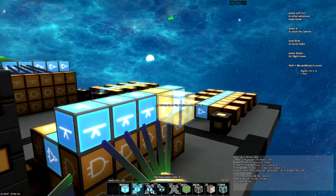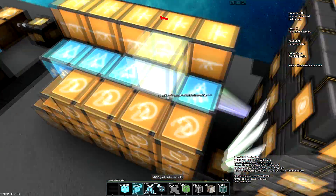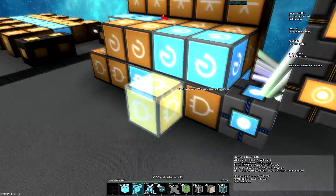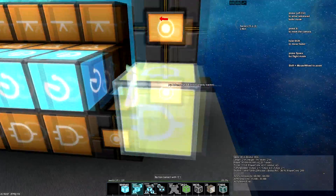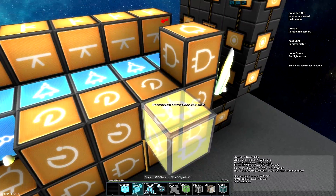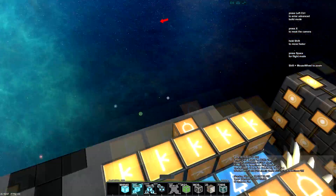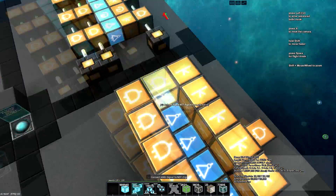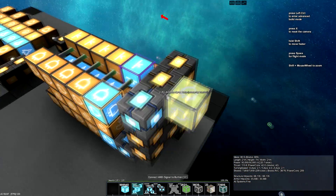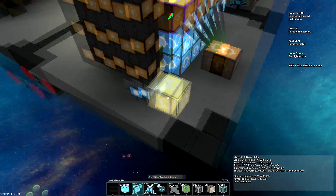So now you can see that when all of these are high, that's high, and then the reset switch will also turn them off. Now we want to take the signal from here — every time we move the shift register position, you'll see that you get a pulse there. That's the pulse we want. So select one of the ANDs and put an AND for every link in the chain. These ANDs all get wired across into the memory, so now any time we push any button, the memory gets triggered. That's because we haven't programmed it yet.